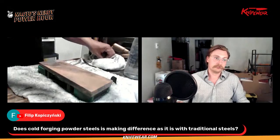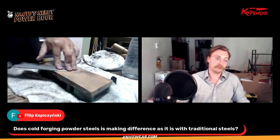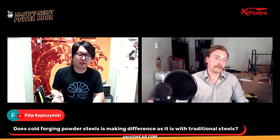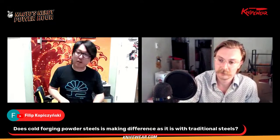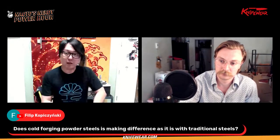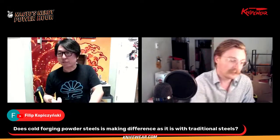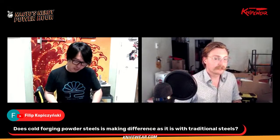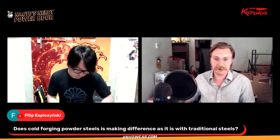That gives the steel enough tension. In the Sanjo area, what made that area popular or famous for knife making and blacksmithing is so-called wakugi, or traditional Japanese nail forging. Those Japanese nails were very low carbon steel. They heat it up and hammer it into tapers and make the shapes. But imagine, because it's very soft steel, if they try to hammer them in, it bends, right? But those properly forged nails don't bend. So that definitely gives you the outer tension to the steel. I need to get me some of those because I have real bad aim with a hammer, and I would love nails that don't bend.